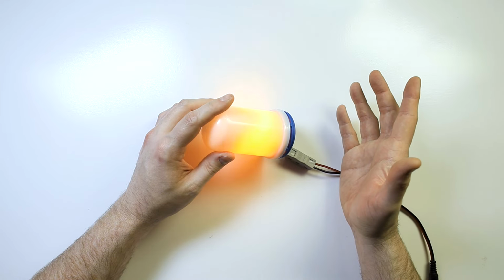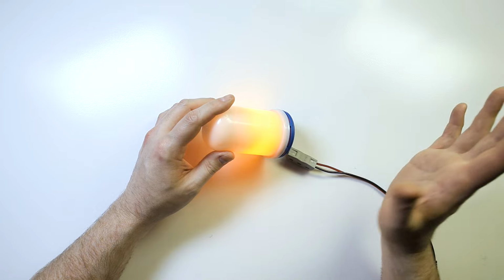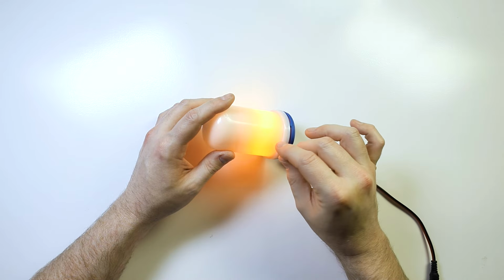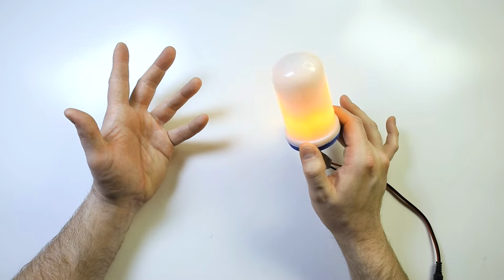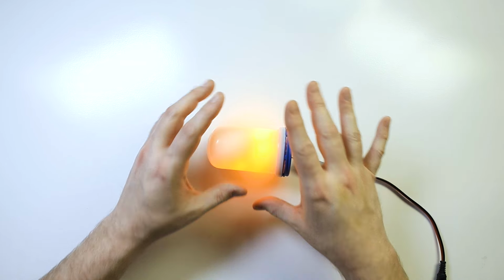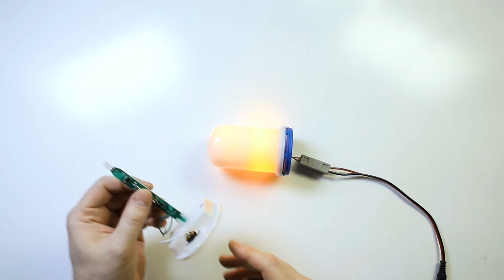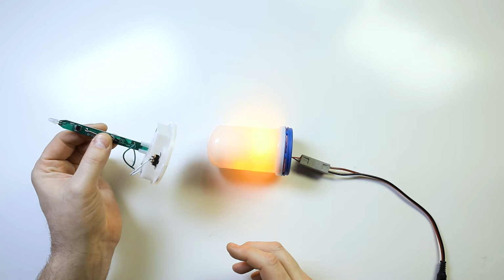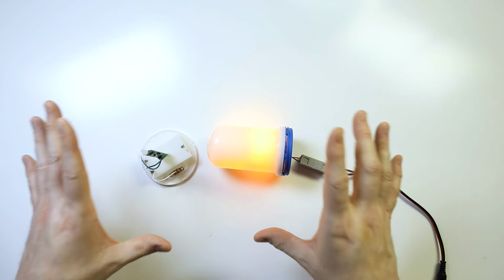Let's say you're using a Fright Props controller that runs 12 to 24 volts, and so you need to drop it down using one of those converters or something like that. That's how you hack your way into something like this. And so now you know how to convert 110 AC and low voltage DC battery powered. You can go forth and make cool new stuff.